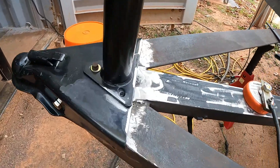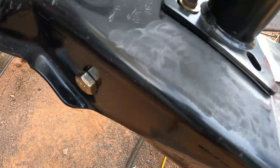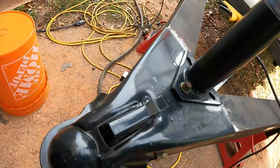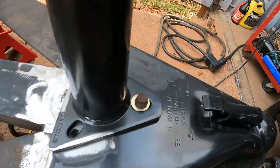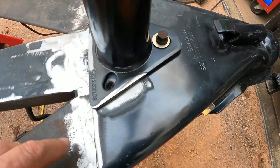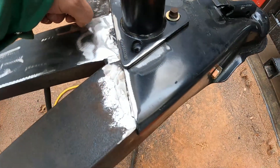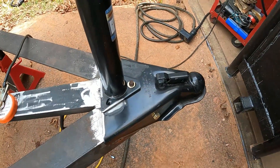Alright, here's where we're at. I got the two big half inch bolts installed with lock washer and nut on the inside on both sides. I got the paint ground off. I got one bolt in the tongue jack. I'm going to go ahead and weld three spots where it'll be easy to cut if it has to be replaced again, and I'm going to weld up the tongue itself here. I'll get that welded and we'll see how it looks.